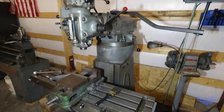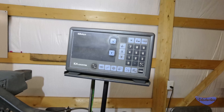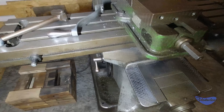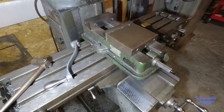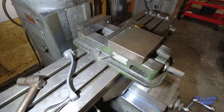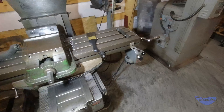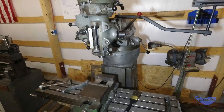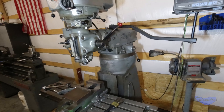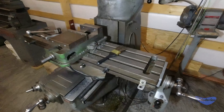It came from a local military subcontractor. It's got a little Mitutoyo DRO with it. The ways look really good all the way around, even underneath the table. I got what I think is actually a Kurt vise — the logo is worn off the side. It came with power feed on one axis. Everything works on it, actually extremely well. It's a pretty tight machine, especially for a guy in his home shop, which is pretty awesome.